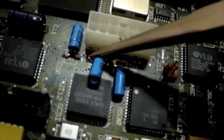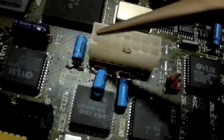That's what I had to do here. I ended up putting a new wire here and reinforced it. Same thing here, and I reinforced it. This connected my 12 volts back up here, the PDS slot, and over at the audio output chip. So that's all reconnected now.